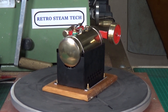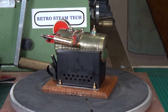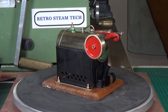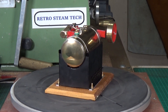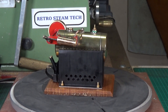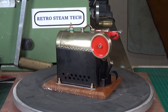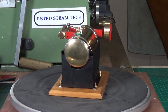There are a couple of things I've had to do — the flywheel and piston were no good so I've remade those, giving it a new piston and a new flywheel. The other thing was that when I went to clean up the bung in the filler tube on the burner, it just disintegrated — I'm assuming it was made from something like white metal. So I've made a new bung for the burner filler tube out of brass. The base was painted originally and I sanded off all the old paint, then decided to go with my normal finishing oil on the wood.